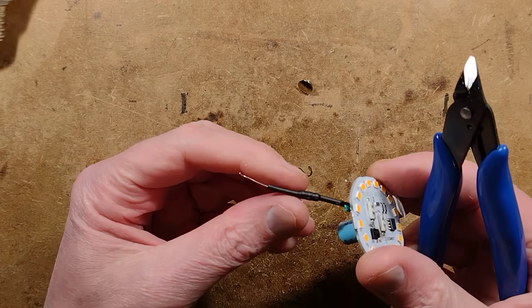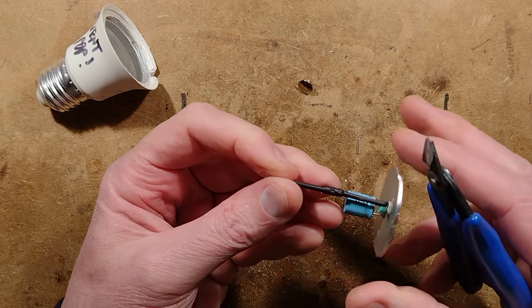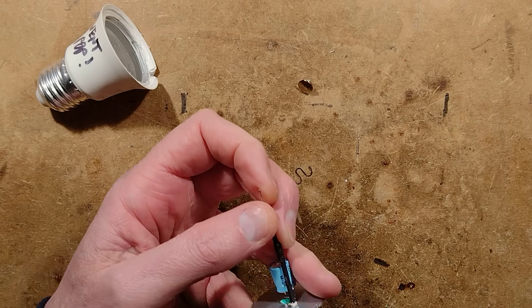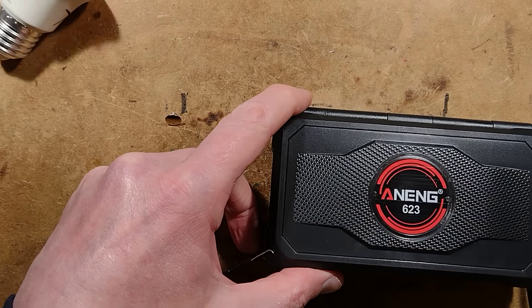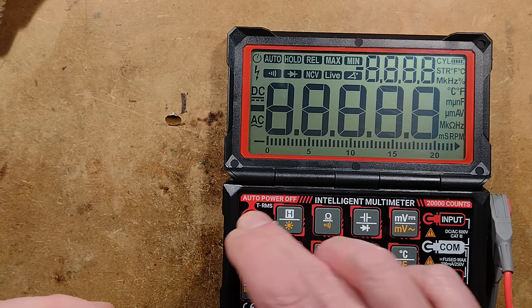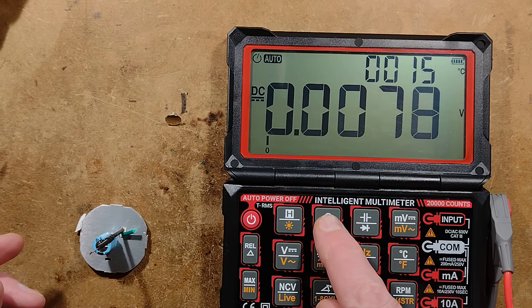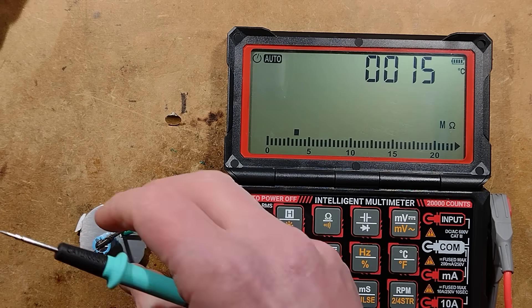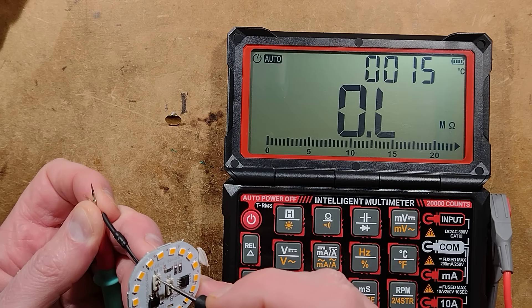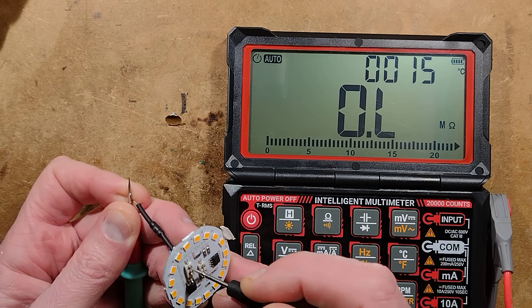This comes out. I would guess the fusible resistor has blown — in fact I can see a little splat on the side here. That's useful to know the fusible resistor has worked. Let's test that. I'll bring in a different meter — the Aneng 623 automotive meter with that very big display. Let's select resistance and see what resistance this fusible resistor is. It's totally fused — absolutely open circuit. Excellent.